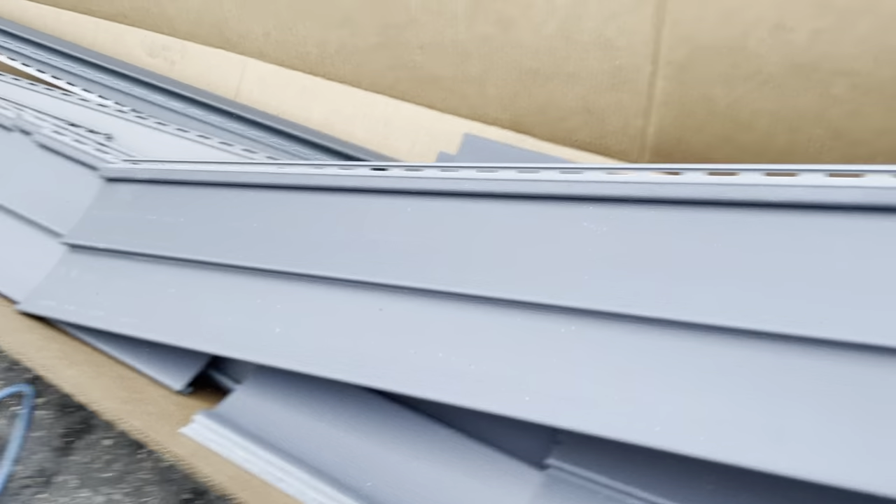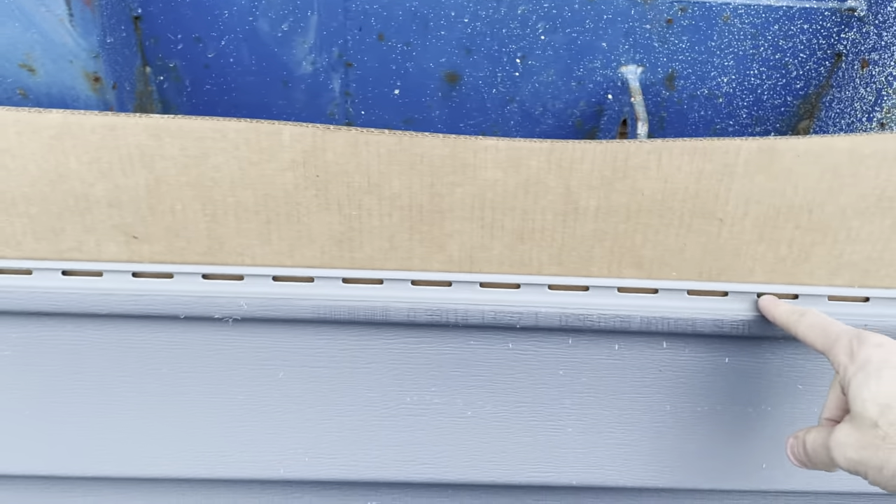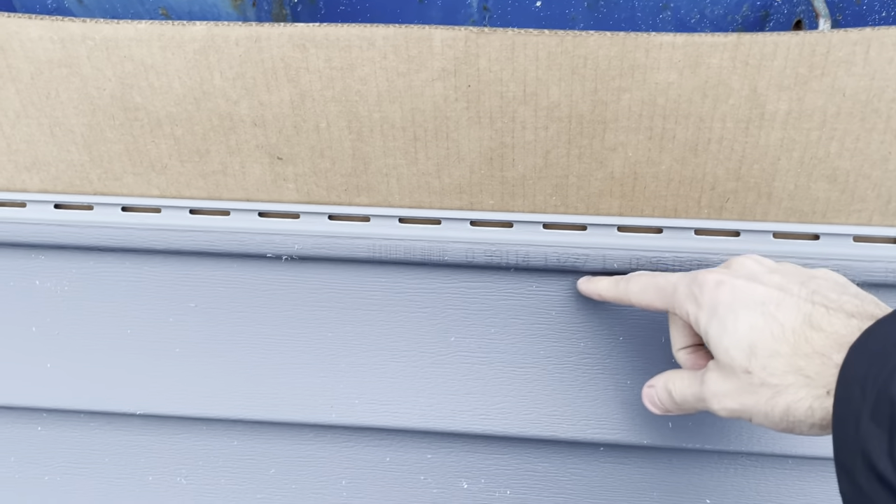Looking at this material box, here's a scrap piece - you've got one lap of siding. They've got double four-inch traditional lap siding here. This is Royal Estate, 0.044-inch thickness, color is Natural Slate. This is called the nailing fin - all siding gets nailed on through the nailing fin. The next piece goes on and locks into the top, then gets nailed in, so the bottom of one piece locks into the piece above.